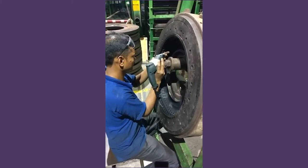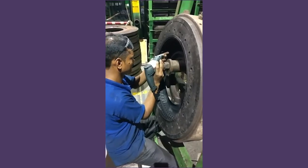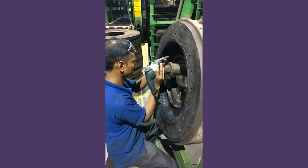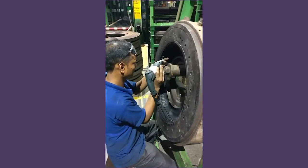The machine which I'm talking about, the vent cleaning machine which I want to showcase today, this is how they do it in the shop floor. So he can do, in less than a second, one hole he does it. We were doing 1.6 seconds, our machine was doing 1.6 seconds. We could do faster. I told him I can program my laser to move faster, but then what will happen? All my optics will go away because of the inertial forces. Because if I do very fast, there would be acceleration, right? And this acceleration will exert forces on my optics and everything.